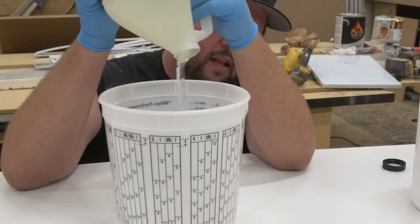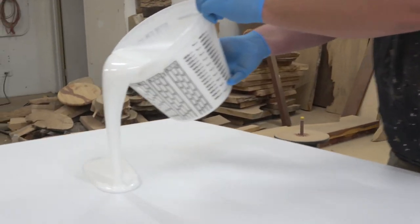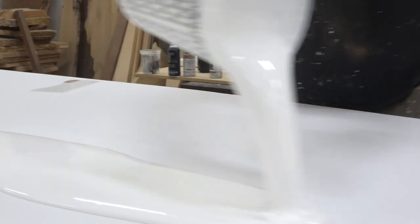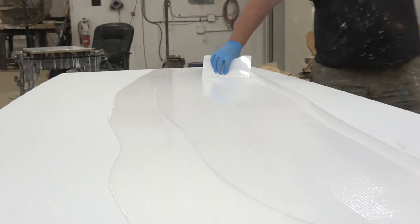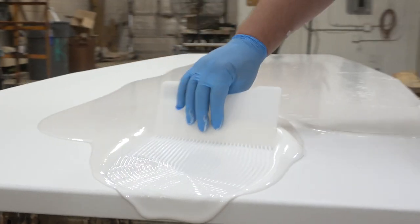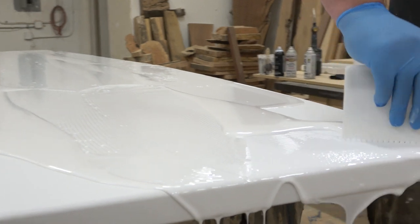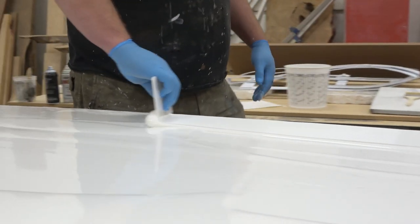So we're mixing this up now. This is a 10-foot table by 4 feet wide — that's 40 square feet at 3 ounces per square foot. This is going to give us about 120 ounces, so we're going to mix up a little extra. We're going to mix up our favorite super gloss tinted white that we're going to pour all over this. I've got my trusty trowel out — I've poured my channel down the center. It's made of a material that the epoxy will not stick to, and it leaves just the perfect amount of epoxy as you drag it to cover your piece.